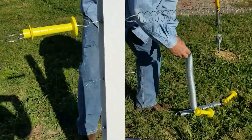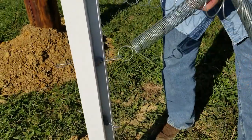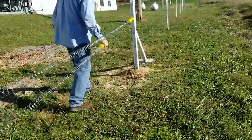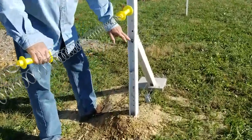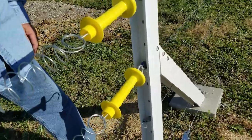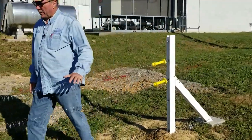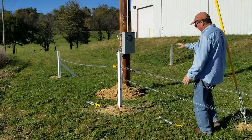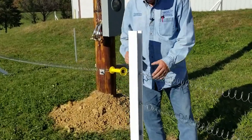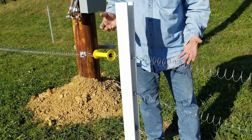Now that we've got our two hooks right here, we're just going to slide this on. Then we're going to take our gate handle — where we terminated our fence, we took a gripple and created a notch for the handle to hook up in — and we're just going to hook our gate in there. It's a very simple process. I'm going to put three on this side and three on the other side. That's a simple way of using a gripple and an extra piece of leftover wire to create your hooks for your spring gates and handles.